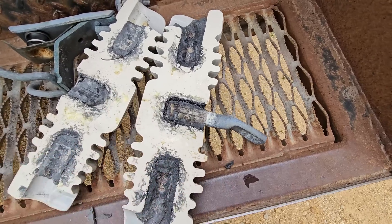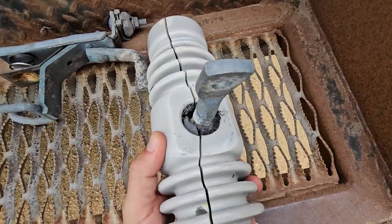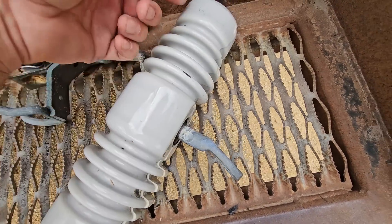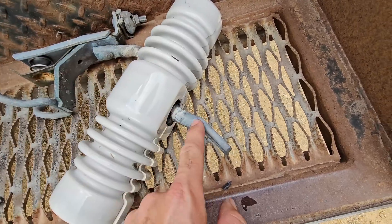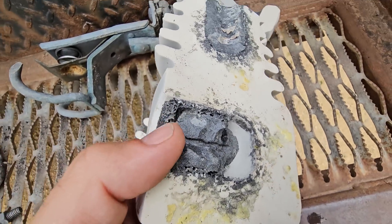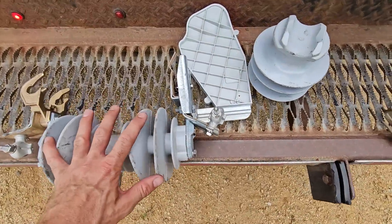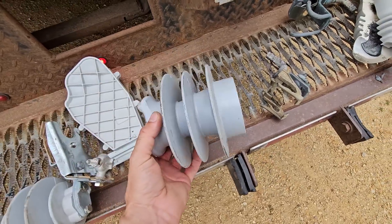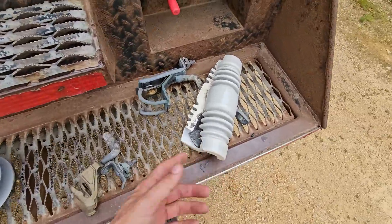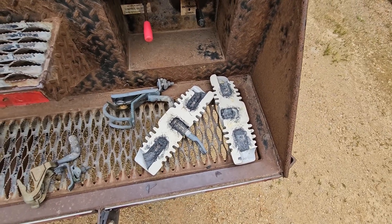One little trick: as I mentioned, hairline cracks can be extremely hard to see sometimes. If you look on the back of the cutout where that grout is, you can see the grout is all burnt. When a cutout begins to fail — if there's some internal cracking or current flow through the cutout out into the bracket — generally you'll see that grout starting to bubble. It's supposed to be really smooth. This technology here is a lot newer so it doesn't apply to these newer ones. Many years ago they were using plastic insulators and I've got an area where they're all starting to burn down, so they're all currently being replaced.